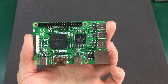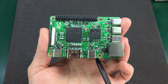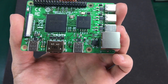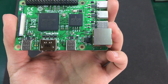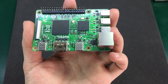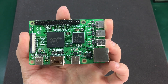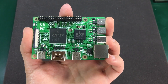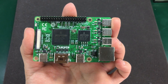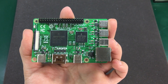The analog composite audio and video RCA connector was also removed, but they have a trick up their sleeve. This second USB Type-C connector right here, if we look closely, it's marked A/V and it does provide analog audio and video connection with the right cable adapter that will be sold by the Raspberry Pi Foundation and probably soon available on eBay and other Chinese sources. It looks like they're using a switch that would normally route audio over USB Type-C but instead they routed the composite analog video over that channel.